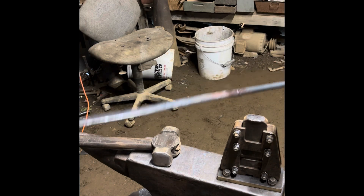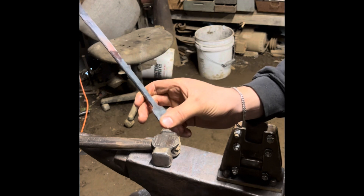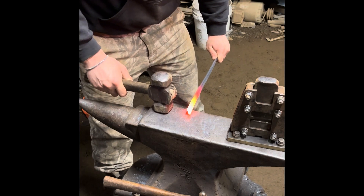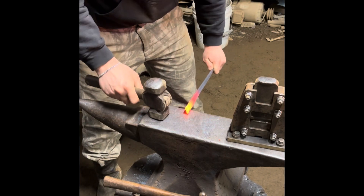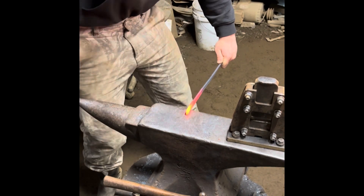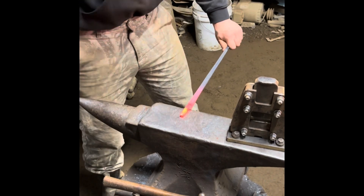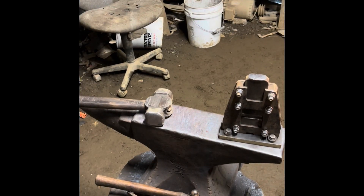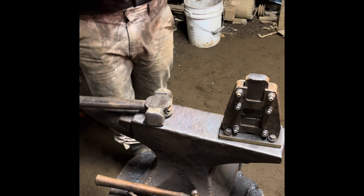Now I'm going to go ahead and forge out the handle, and then after that take the scratcher part, just give it a little bend, and then give the whole piece a nice little bend. Half on, half off here, just set that shoulder — about an inch and a half of material or so. I'm going to take one more heat and clean that up a bit, and then go ahead and throw my touch mark in there. I forgot to hit record, but all I did was bend around that taper into a handle and add a little scroll in the end.